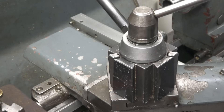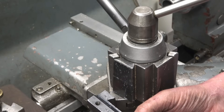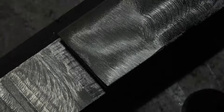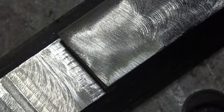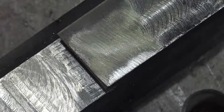I'll use silicon bronze because if I were to put steel on there, it'll probably make some sort of horrible hard alloy that's impossible to machine. It's a little bit annoying, but it's not the end of the world. I've buffed the surface with a grinder and I'm going to lay some silicon bronze on here. You don't actually melt the base metal — it's a bit like brazing. If you melt the base metal, you end up with some horrible alloy that you can't machine.